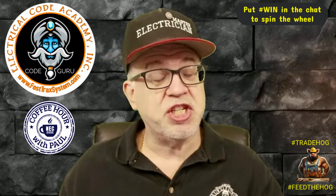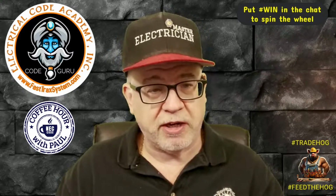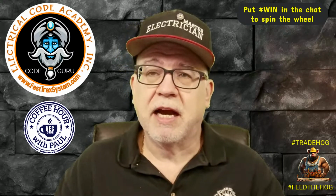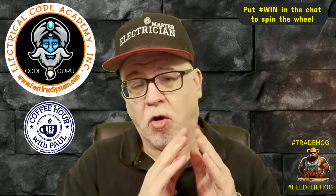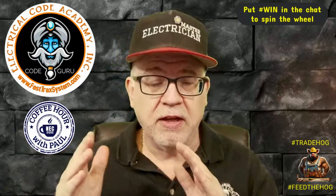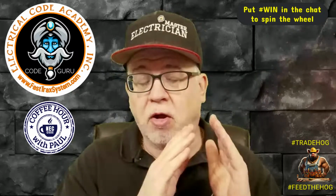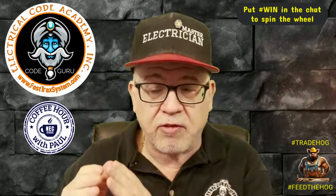So it's now G in the 310.10(G), and basically it talks about your characteristics. So paralleling, if you're going to parallel feeders, they have to be at least 1 aught and larger, okay, for paralleling. You have to follow all of the rules, the characteristics, okay? So all the A's, if you had A, B, and C, and you had multiple sets, then you have 2 A's, let's say, 2 sets, 2 A's, 2 B's, 2 C's. All the A's have to be the same conductive material, all the same length, all the same characteristics, same for the B's and same for the C's.